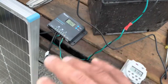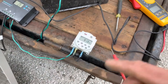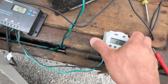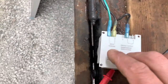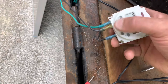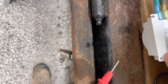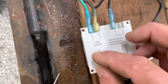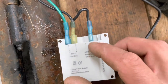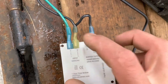Disregard all this stuff — this is just a little solar setup I've got going here, but at the end of the day it's just being fed with 12 volt power. I'm using this to switch on and off a 12 volt irrigation pump. To wire it up — really simple — it's got a little battery in it that will keep your settings, so your clock will keep running even if you disconnect it from the 12 volts and you won't lose any settings. You've got your input positive and input negative, and this is your switch side — you can do either a negative switch or a positive switch.